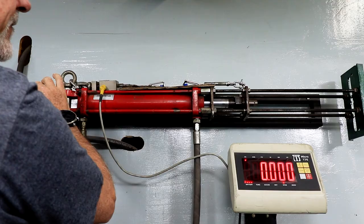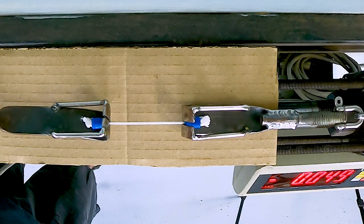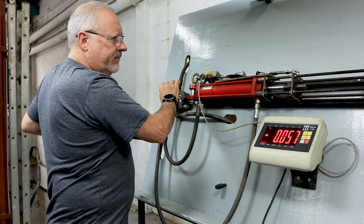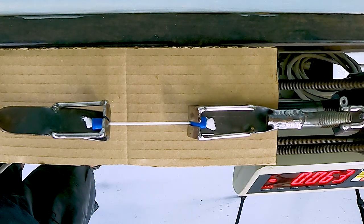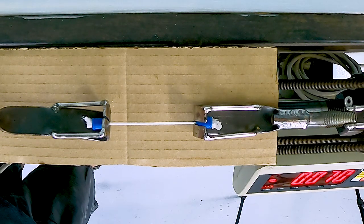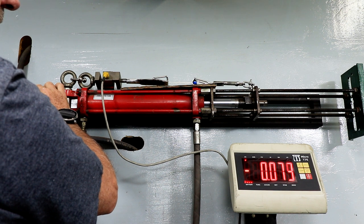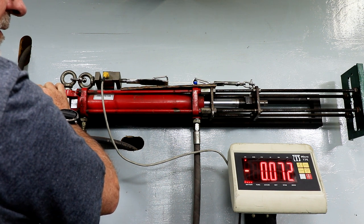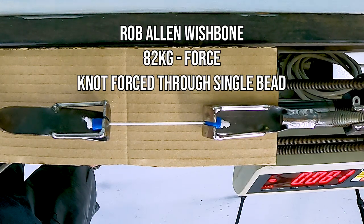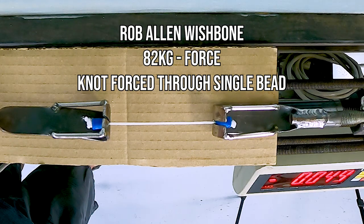Here we go. We need about 45 kilograms to make it work. So that's the max you'd ever pull with the rubber. Let's take it further. A little bit of tensioning. You'd never pull this much with the rubber and it's completely exposed here, so all the stresses are on the bead. Slowly starting to deform the bead. So that's like 160 kilograms. Remember we're pulling individuals apart, whereas in a rubber you have two ends, so you're doubling that figure.